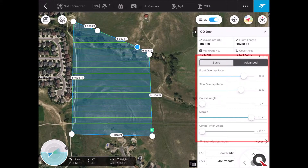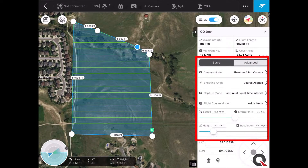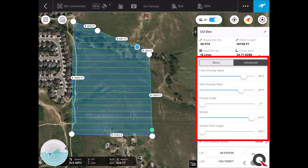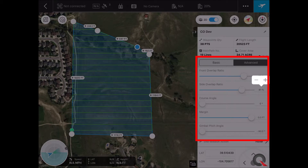Now let's check the advanced tab. Our front overlap is set at 85%, which is fine. That might seem like a lot, but we always tell contractors we'd rather have too many photos than not enough — it's usually impossible to go back out and recapture that data again. This will also adjust your flight speed. If we back that off a little bit, we'll get up to 18 and a half miles an hour, which is a lot of times just a little bit too fast. So we'll move that back up to 85% and leave it alone. We don't like to see that front overlap go below 80%. Side overlap is set at 80%, which is just fine. If you're flying a very small area — maybe a small development like a gas station, or even just a stockpile — and you're not coming up with very many photos or just a couple of flight lines, you can bump this side overlap up to get more flight lines and more photos for a given area. But for most projects, 80% is just fine.